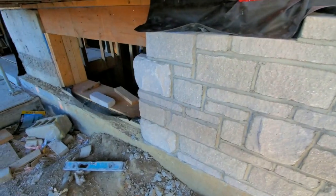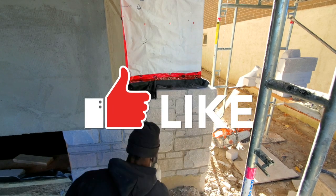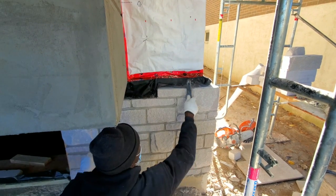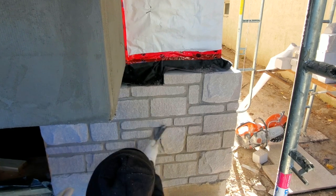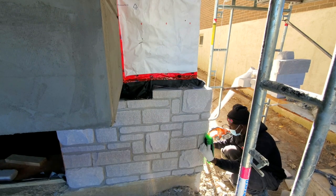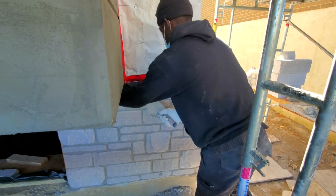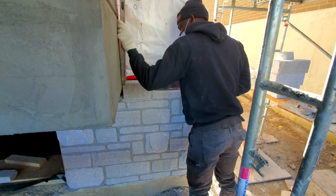If you're getting value so far from the video, go ahead and give it a thumbs up — it really helps the channel. It's very important to keep a nice clean looking stone. One of the factors to keeping the stone clean is to always cut the mortar away from the joint and wait until it's dry properly before you go ahead and joint it. I hate to see when the stone is messy all over the place.